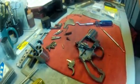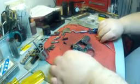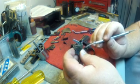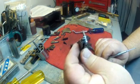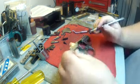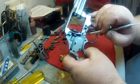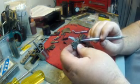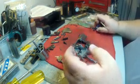I need to come up a little bit. Here, too far down. Back it up. Okay. So what that culprit is on the hand, the pivot pin, is coming through and is sticking through a little bit too far. Hopefully that's coming through and you guys can see that. Just going to rotate it a little bit and let you take a look at that. And so that's rubbing on the frame right here. Okay, so that's something that we'll need to watch for. We're going to replace this part anyway, but when we put the new one in, we'll make sure that it's not sticking all the way through like that, so that it's not going to rub on the frame, because that'll cause drag, and you don't want drag because that's going to ruin your trigger pull.